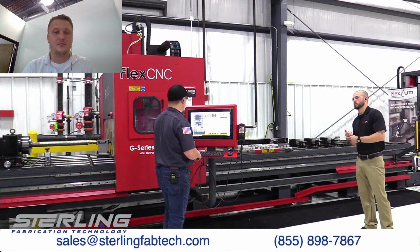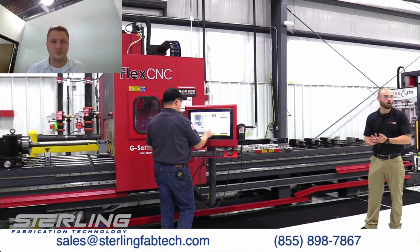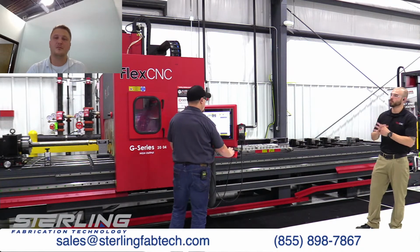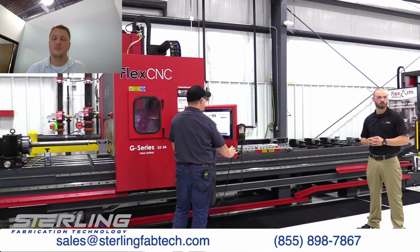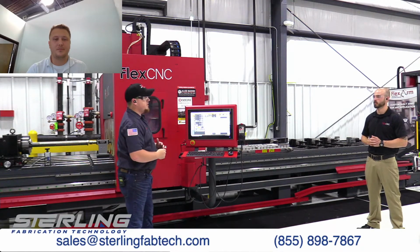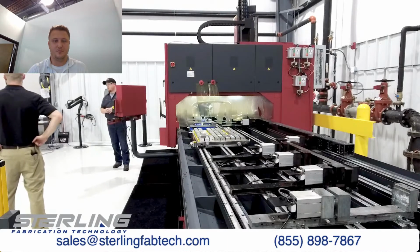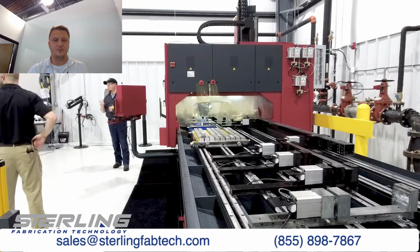I'm going to go ahead and load up the program for the next part that we got here. There we go. So if you don't mind, briefly, what is our third operation, Aaron? Third operation is we have a 1/2 by 6 inches long. We're going to be drilling some more holes and then drilling a little bit bigger hole in the center. We have a 3/4 inch drill that we're going to showcase, and then we're going to machine a counterbore on